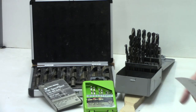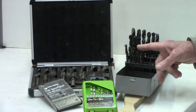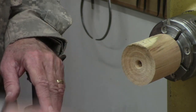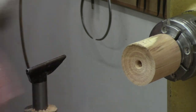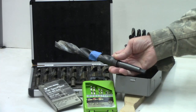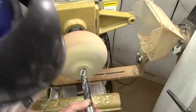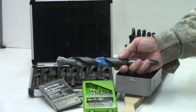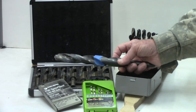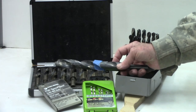What do I use them for? I use them sometimes for drilling on the lathe. A lot of times I use them for hand drills, since Brad Point bits tend to be kind of grabby. Here's an example of a very large one that actually uses a Morse taper instead of a standard shank. I really like this for drilling holes in hollow forms — it'll drill a seven-inch hole that's one inch in diameter. They do tend to get kind of pricey, but I got a good deal on it years ago, so I'm reaping the rewards every time I use it.